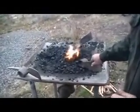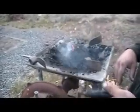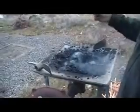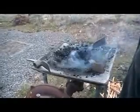And so why don't you just use a grinder to sharpen it? Well, you would grind away material, which wouldn't be good, and the grinder wouldn't draw your pick back out longer again. You want to draw it out, and it wouldn't re-temper it either.